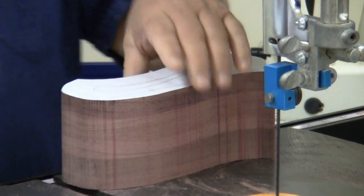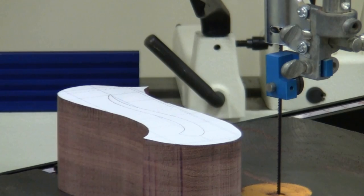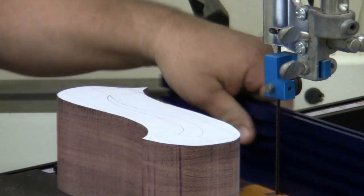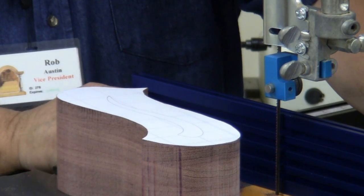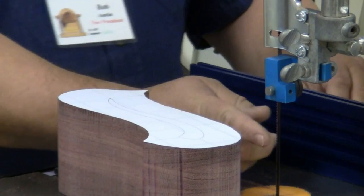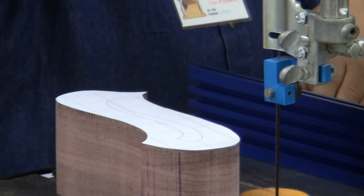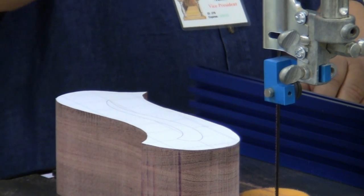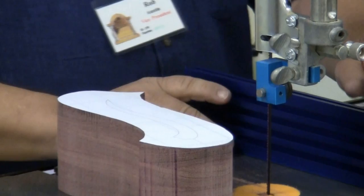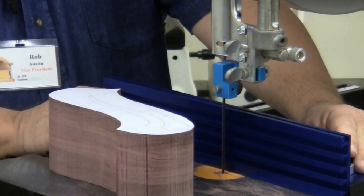That's why these guys at these shows that have rolled that wood around left and right and all that kind of stuff, is because that blade is meant to, it's supposed to flex. Move sideways, which is contrary to any. So you're saying when you have the Carter system, you don't tension the blade as tight? No, this is tight. I'm not sure if they did it on purpose, but look, it's actually the tension is tight enough on here that you would use it on a 3/8 blade. And they set it up for me, so. Over-tensioned it. Yeah, they over-tensioned it. So I'm just wondering with the Carter system if you were supposed to do that on purpose.